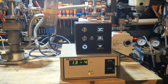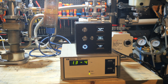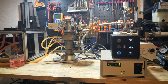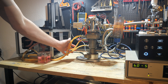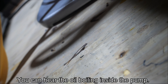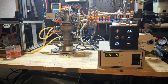I have now turned on the ionization gauge and it seems like my pirani vacuum gauge has bottomed out and can't measure any lower pressures. We will now use the ionization gauge to monitor the pressure. Up until this point we are at around 6.2 times 10 to the power of minus 5 torr. The cooling system of my cloud chamber seems to be holding up great — the water isn't even warm to the touch. We are now at 2.8 times 10 to the power of minus 5 torr and the pressure is still falling, but I will stop here.